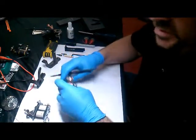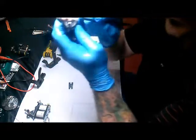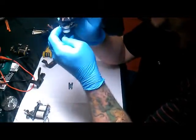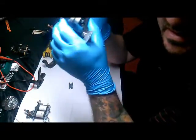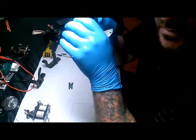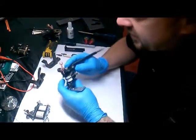So spring setups, generally, if you want a strong hit, for example, this machine that I built is a liner, okay? You can tell because of the short front spring and a stiff rear spring with a little less stiff front spring. That's just my preference. The spring tension is still the same. For my shop, I run my spring tensions for a liner at 425 or so.